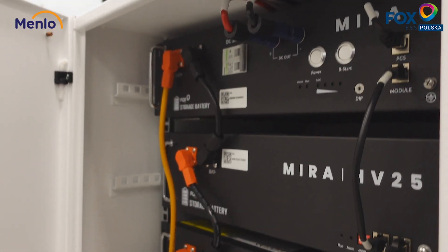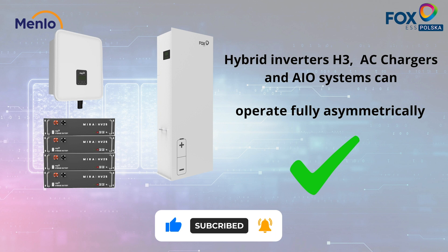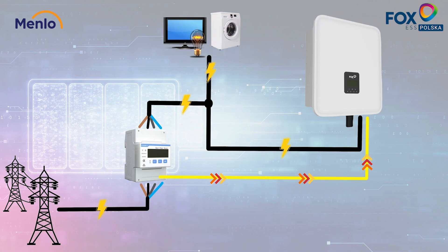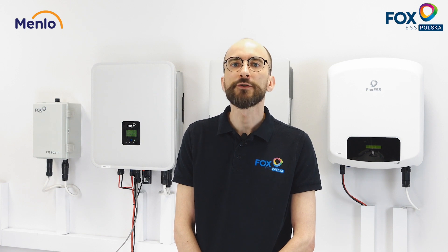The entire battery system can be enclosed in a battery rack made by our partners. It's important to mention that H3 series inverters, as well as their twin all-in-one systems, can operate asymmetrically. Thanks to information from the smart meter, we can provide enough power to satisfy the energy demands of the load without exporting or importing energy on other phases. We also have an all-in-one system working on the same principle as the H3 series, but with the BMS, batteries, and inverter housed in a single unit.